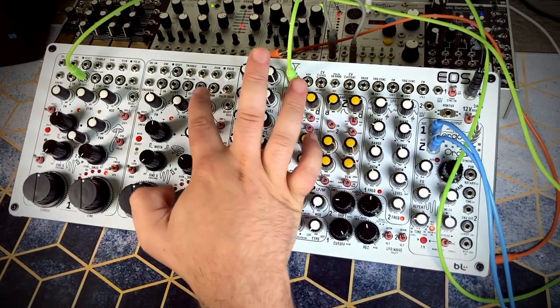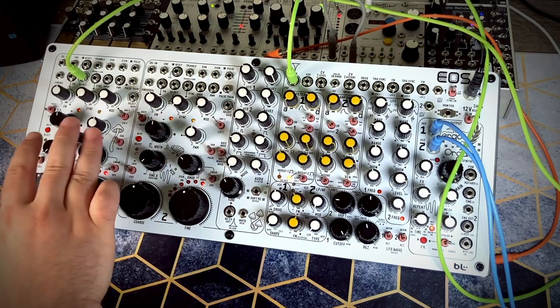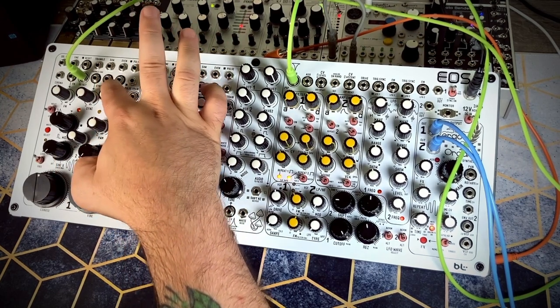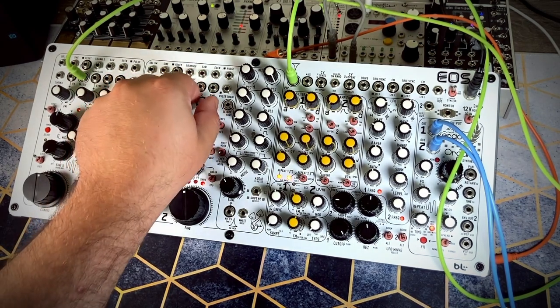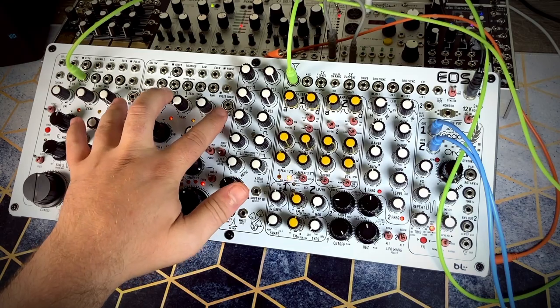We can cross mod each oscillator into each other by adding it on the first oscillator as well, which gives some really crazy sounds. We also have the mod input, which is internally patched from the envelope — note that we can override these inputs with the inputs above the oscillator, so all these internal patches can be overridden. For oscillator 1, we can mod it with the envelope, so any time the envelope is fired it sends the envelope into our oscillator — great for percussive, not so much for melodic leads. Or we could mod them with LFO 1.